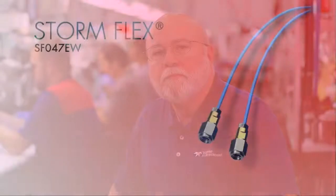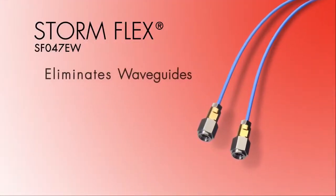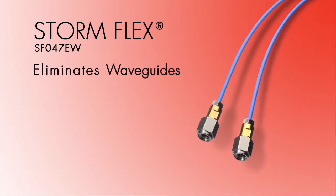A cable that can withstand handling and flexing and yet still match the original insertion loss and VSWR performance at frequencies that were previously addressed by waveguides. Meeting this need was what led us to develop the Stormflex 047EW cable.